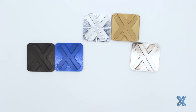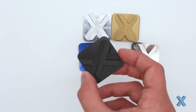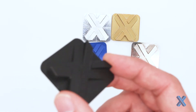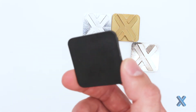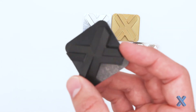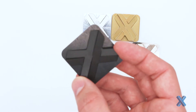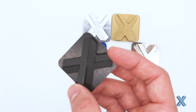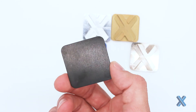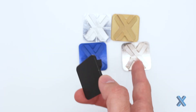Blue anodized is great for that slight increase in durability, making it non-conductive, and giving lifetime corrosion resistance. Then we have hard coat anodize — this is black here. This is a type 3 hard coat, and unlike type 2, it actually has a little bit of growth to it, maybe about a thou or so extra, giving it extra durability over time. Similar properties to type 2, but if your environment has high wear, high ruggedization — defense, aerospace, military — then we're going to be using the type 3 anodize.